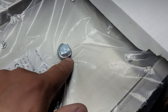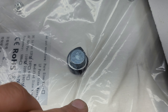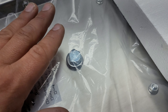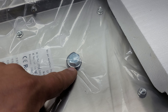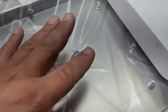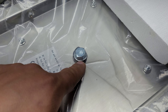So it's very important that as soon as you get your new Power Jack inverter — it doesn't matter what size it is because they use these for all Power Jack inverters — it's very important that you look on the underside of the inverter and check this black insulator. If it is broke or cracked or you see pieces around, especially in this area here, immediately get a hold of Power Jack through the seller — eBay, Amazon, whatever — and let them know. Send them a picture of it and they will likely have you send it in for service or send you a replacement. This here, believe it or not, does require major surgery to get to.